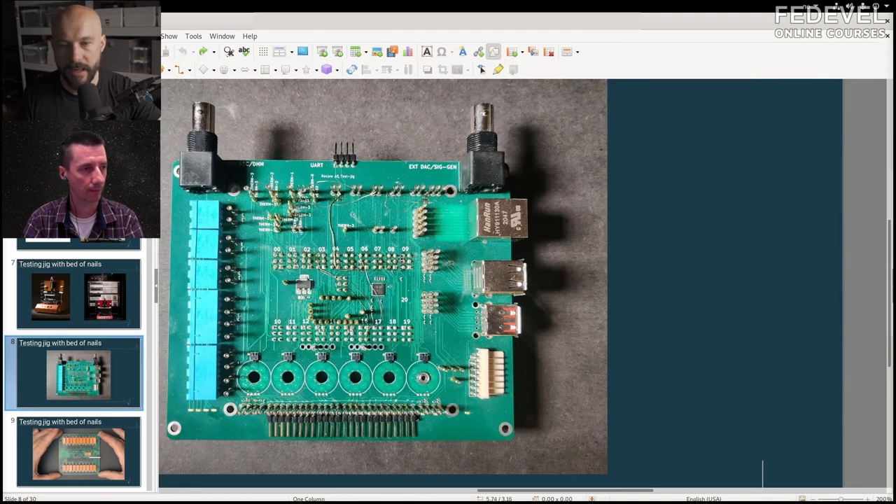I've created a tree of voltage domain testing. I have one voltage meter and I can route the different voltages to that voltage meter in real time. I can go through all the different voltages and test whether they are within spec or not. I also record it and make a test document that comes with every board.